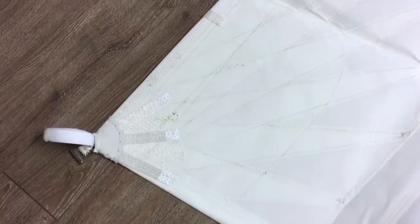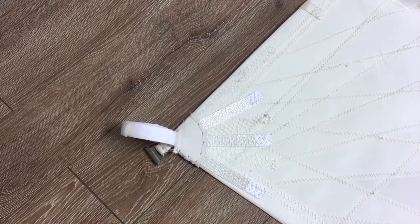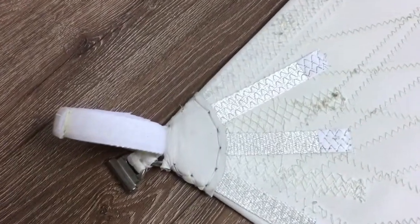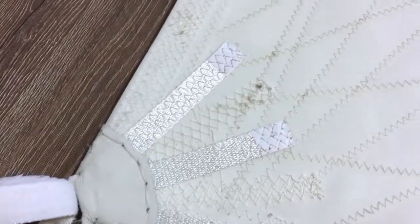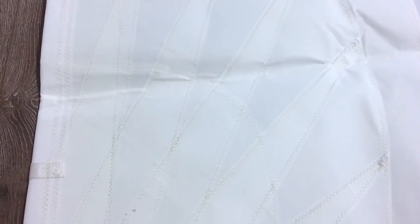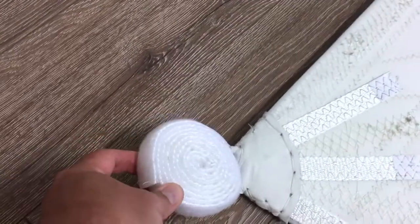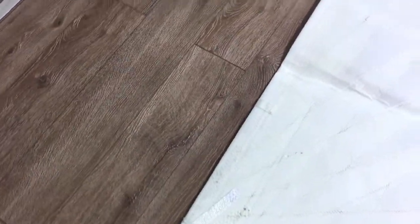Let's check out this clew corner — we've added some really nice things here. He does have a slider that goes down the boom for the clew corner, and we've wrapped that corner in leather as well just to make sure it's extra protected. Love these radial patches. We've also included a velcro strap, because this clew is a bit tricky to get to — we wanted to make sure this gentleman didn't have to worry about that clew slug staying where it's supposed to be.